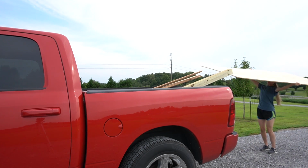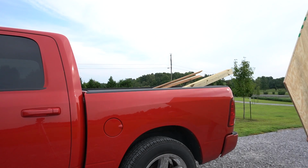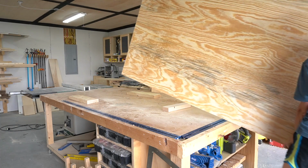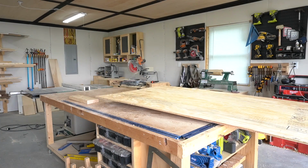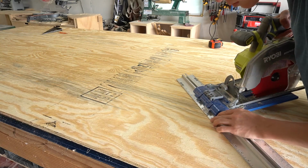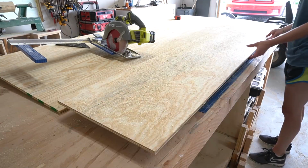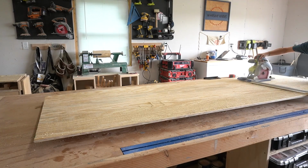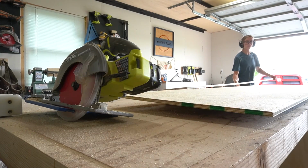I made this box simple, using only a single sheet of 1/2-inch exterior plywood, a treated 4x4 post, and a few cedar boards for the door and the roof. I've got the dimensions, details, and cut list in the plans linked below, but I'll cover assembly and some of the helpful cutting tips in this video. The first thing I did was cut 2 strips from my plywood sheet, one 16.5-inch wide and the other 23.5-inch wide. I set the leftover strip off to the side for now. I will use it later.